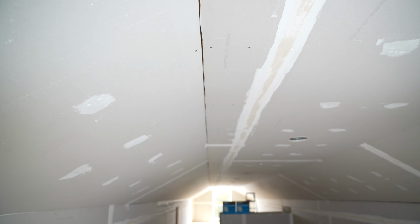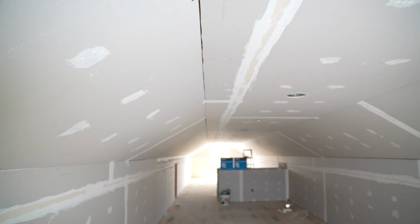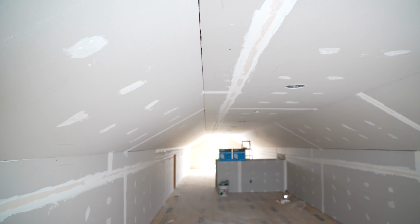We're going to use the green lid drywall mud with a 6-inch knife. This is the joint in which we're going to install the flex corner or the NO-COAT on. As you can see, there are some gaps, and this is 63 foot long. So this is a really long corner, but we're going to attempt it using the NO-COAT.